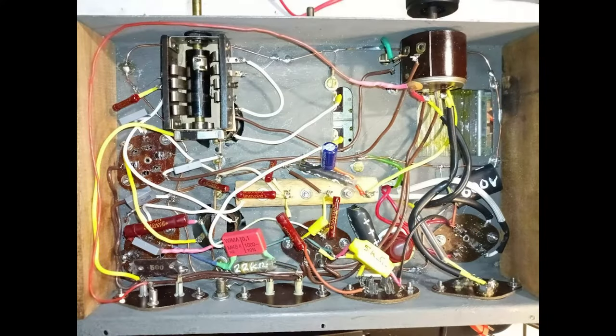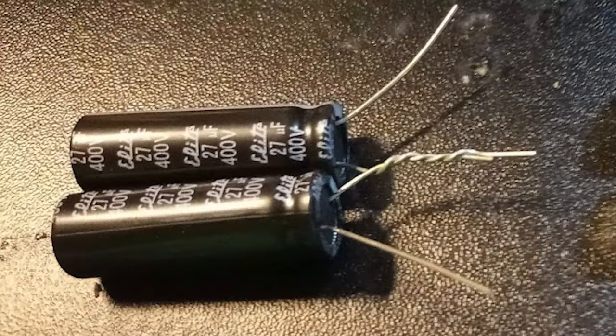The remaining components are installed, keeping most of the old resistors, but changing all the capacitors. However, the spaghetti result is not what was planned. To cope with the initial voltage surge, the new filter capacitors are obtained by putting a couple in series, which otherwise have individually only a working voltage of 400 volts.